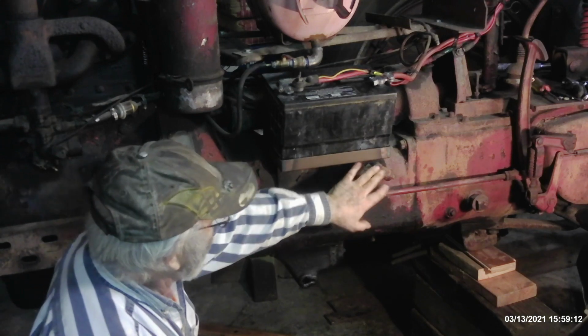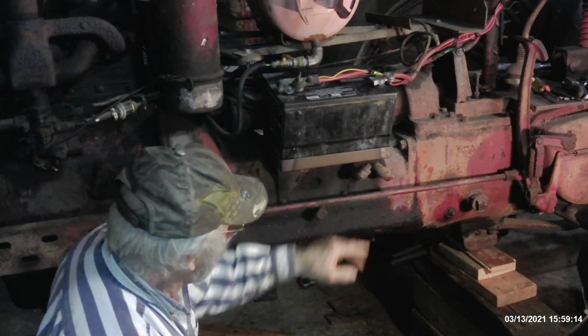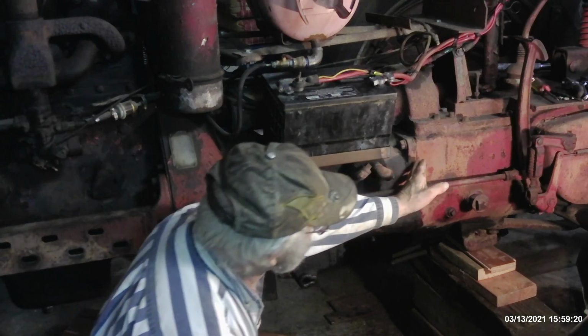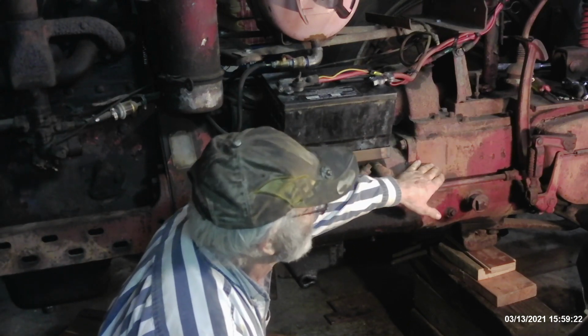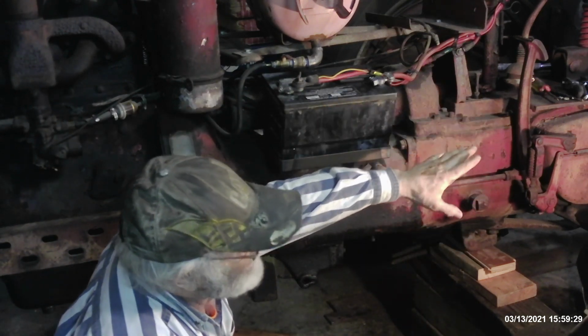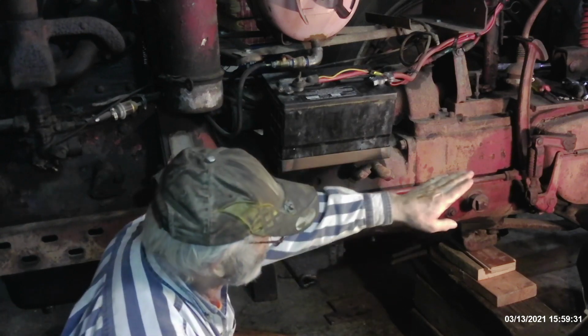This is going to be the hydraulic from the belly pump. The hydraulic fittings, there's still another one on the other side. This is what I'm going to call the torque tube. And then this is the leading edge of the transmission final drive housing. The transmission is right here in the immediate forefront. Then the final drive is actually where the pinion and the bull gears go to the rear axles.